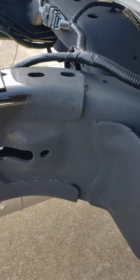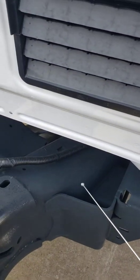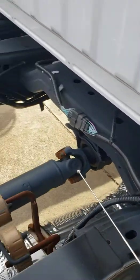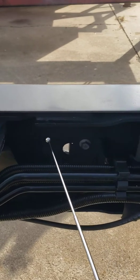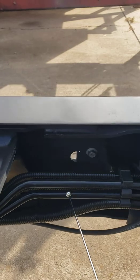If you're looking, you'll notice that this frame tapers, widens out, and then tapers down to go underneath the cab. You'll also notice there's a fitment weld here where it goes from a boxed frame to a channel frame, and you can see a little better there where they did the weldment and it came through.